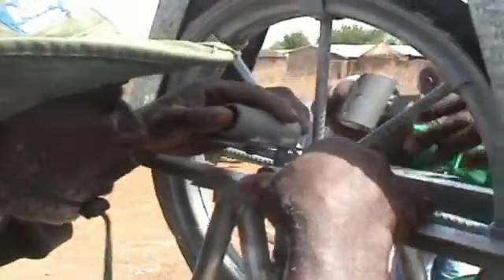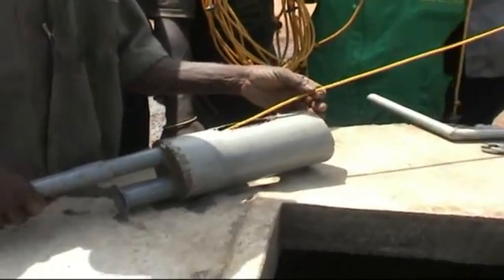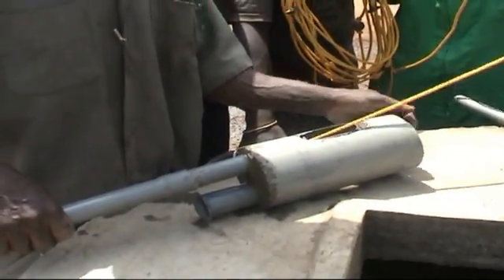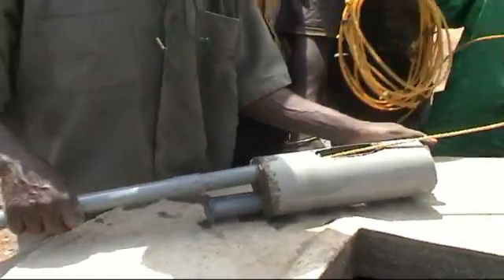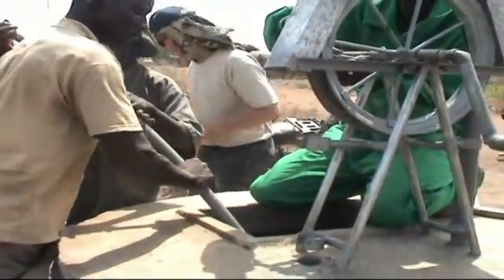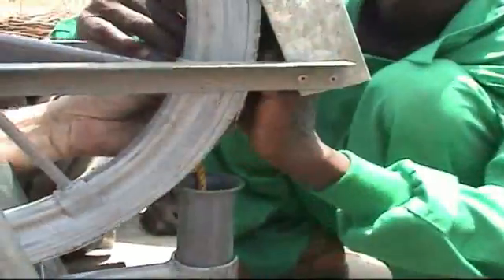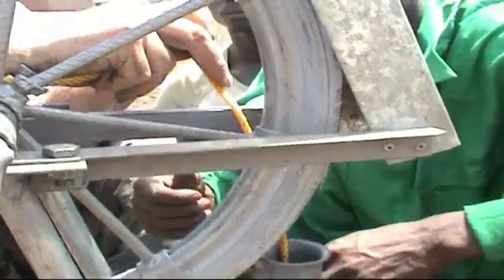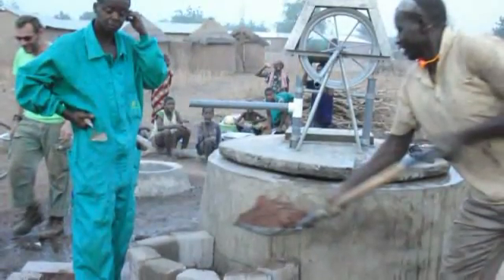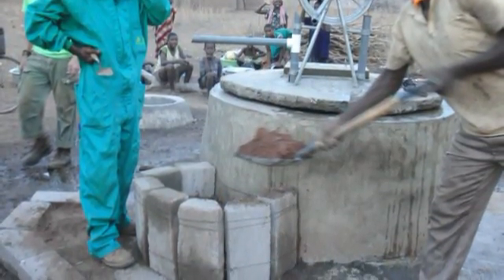Musa places the heavy duty bushings. The rope with washers is pulled into the PVC rising pipe. The rising pipe with the concrete turning point can be lowered and placed on the well bottom. The rope is put around the wheel and adjusted to the correct length and tension. Blacksmith Tido makes steps for each approach of the pump handle. The life pump is ready for use.